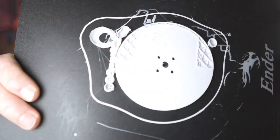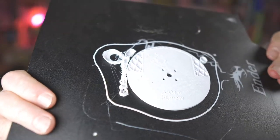I've had this before with these Ender Pro printers. The hot end, I think, after serious usage, which these ones get, kind of gets bunged up and you basically just need to replace it. What happens is, if I can peel this off, I can actually show you the effect that happens on there.